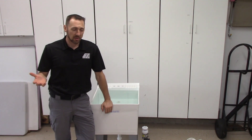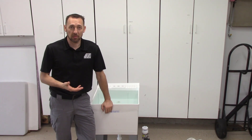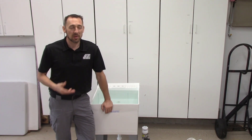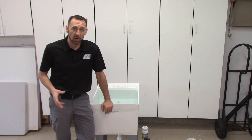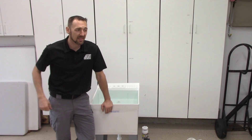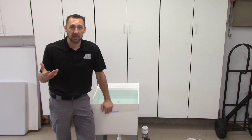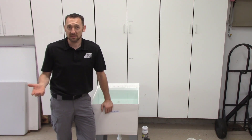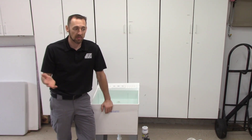One of the inspectors on my team, Inspector Joe — also plumber Joe, a home inspector and licensed plumber — brought up to me that I should really do another test showing what happens when it's already installed and you have a clog at a sink drain. Let's say the clog is happening down in the basement. If you have sewage that wants to back up into the sink, wouldn't it be logical that it might back up out of your air admittance valve and make a big old mess inside your sink cabinet? Great point, Joe — so I'm doing that test too.